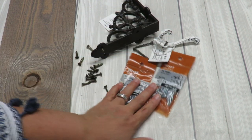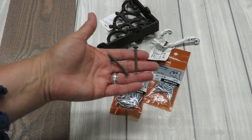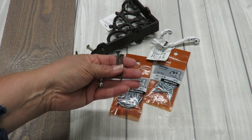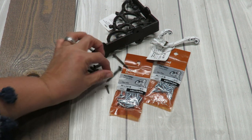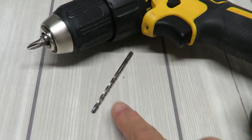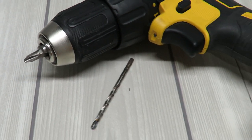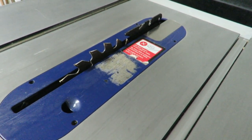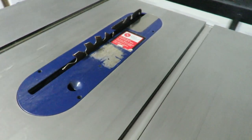Just to let you know, you're going to need an assortment of screws — keep that in mind. I also have two longer screws for anchoring the shelf to the wall on the two-by-fours already marked with nails. Those little nails aren't going to be good enough; we'll use actual screws. You're also going to need some tools: something to drill with and a screwdriver. I'm using a drill that comes with a drill bit and a Phillips head. You'll also need a saw to cut your wood — I'm using a table saw, but you could use a circular saw, jigsaw, or even a hand saw.